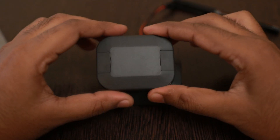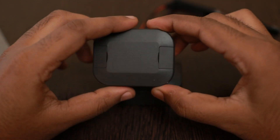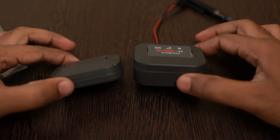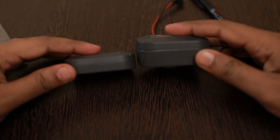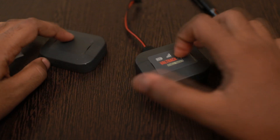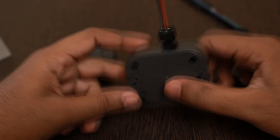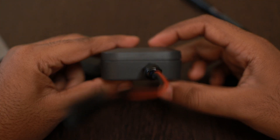Originally the enclosure lid would have looked like this without the sticker. This is the same size enclosure in a thinner form factor — the thickness is less and the space available for the battery is also less. We chose this enclosure particularly because it can support a cable gland here. This is an 8mm cable gland from Takachi enclosures, needed to make the box waterproof.